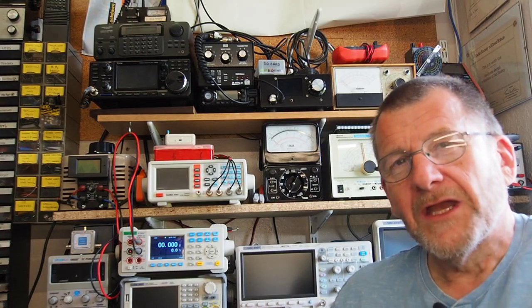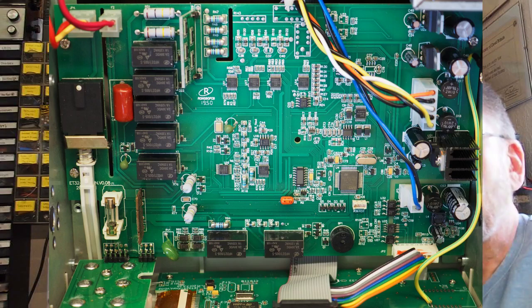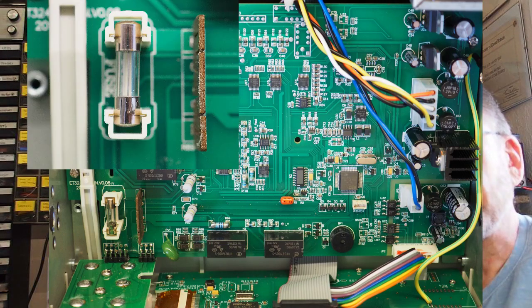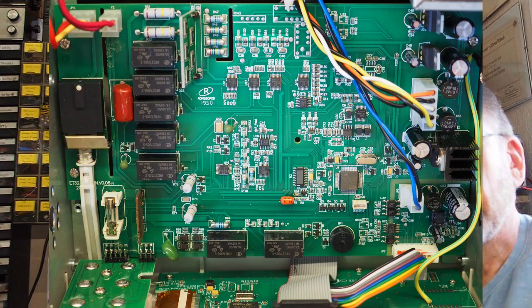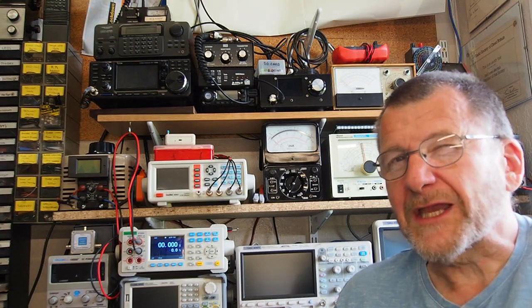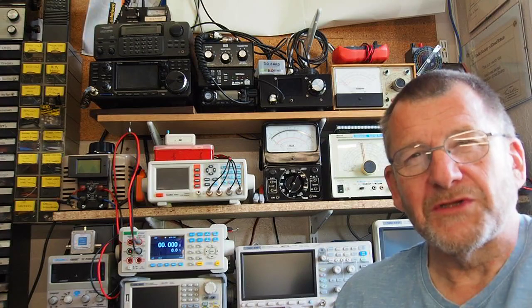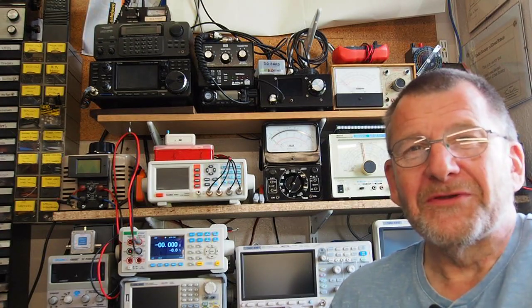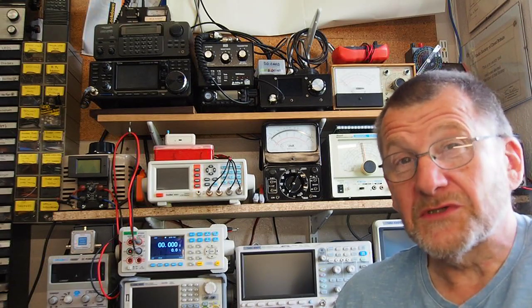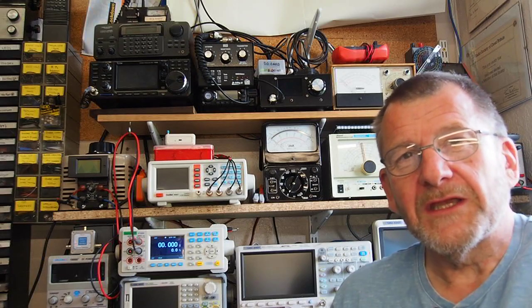On Mads Tech's video, he's got some bodge wires on his main board. I've had my instrument apart and had a look — here's a picture of the main board — and there are certainly no bodge wires on mine in that same area. My fuse is also clip-in rather than soldered, which is a positive. I noticed that Mads Tech's board appears to be version 0.06, whereas mine is version 0.08. It's tempting to think they've sorted those issues out, except that Steve's SDG Electronics board also appears to be version 0.06 with no bodge wires — so who understands it!